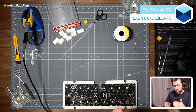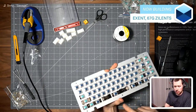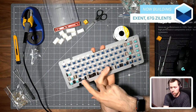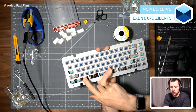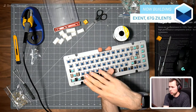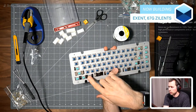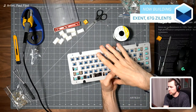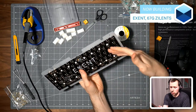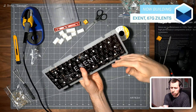First I thought it was, so it was the whole column, and also when I plugged it in, it was going nuts, and it was very clearly the alt key that was pressed the whole time. So I knew it had something to do with the alt key, and the whole column connected to the alt key wasn't working. So I used keyboard tester, and every time I plugged it in, that whole column would turn red. The alt key was going crazy. So I checked all the solder points, and they all looked fine, including the alt key. I didn't touch anything I wasn't supposed to.